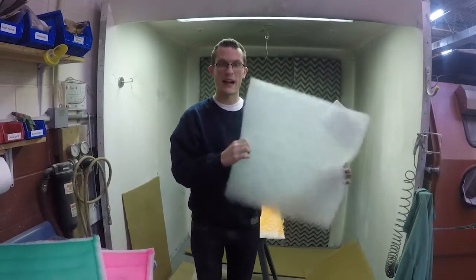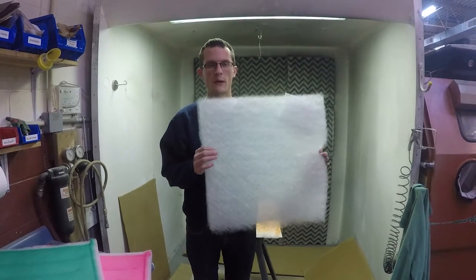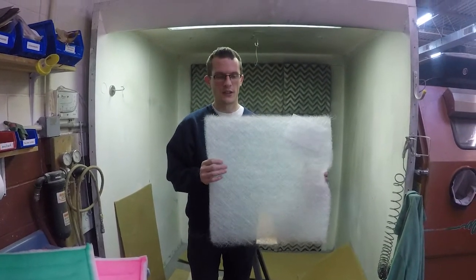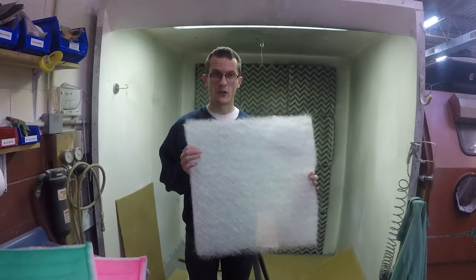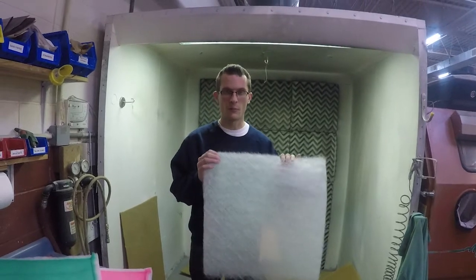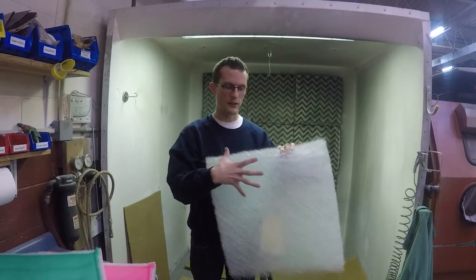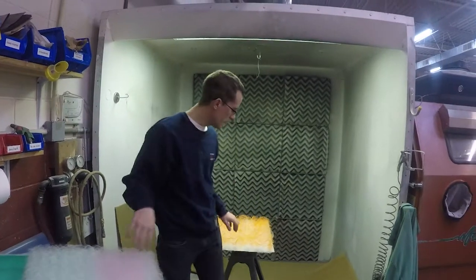They aren't 99% efficient like the 22 grams that we just saw were. These are about 98% efficient. So that can create overspray on your fan blade if they're the only filter you're using, and ultimately they will load up with overspray a little quicker because the filter itself is not as thick. So that's a 15-gram style.